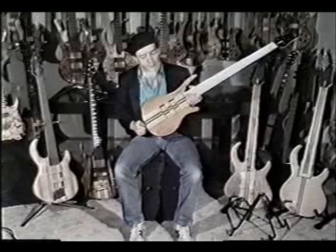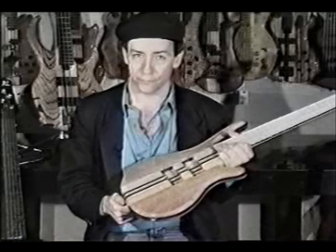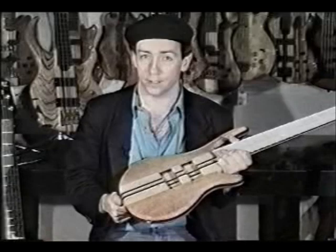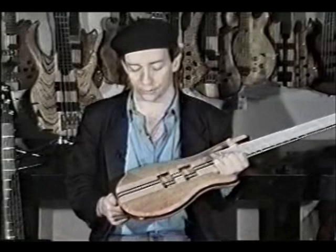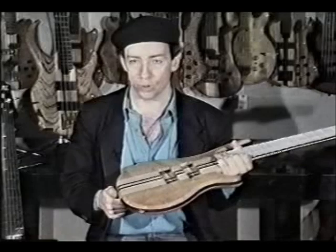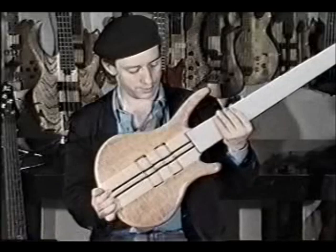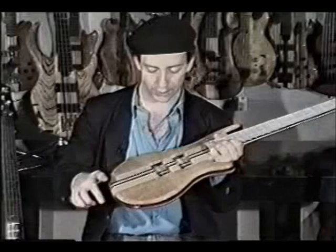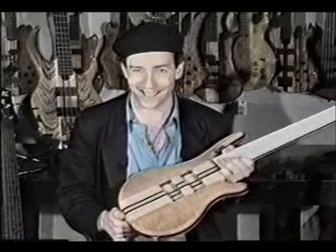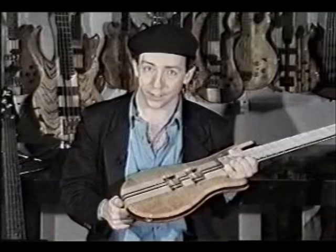Let's take a look at one of the R&L instruments that's actually in the process of being built now. This instrument just came out of the spray shop this morning, and it has four out of the 16 coats that are actually applied to the instrument before it's finished, with buffing occurring between each of those coats. You can already see the incredible grain and the depth of the figuration in the wood. The top on this is an incredible piece of gemstone figured maple — to find the place in the grain that has that special depth, that almost 3D quality, and position it on the instrument properly is really an art form, and that's what these instruments are all about.